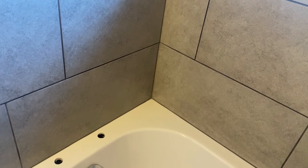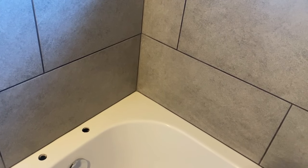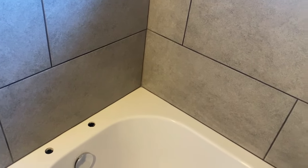Back to my channel - I've finally got the whole of the bathroom grouted, so now I'm going to mastic all the edges, up the corners and around the windows. There are two golden rules before you start: one is to make sure the tiles are clean, get all the dust off; and the second is to make sure there's no water anywhere - even if the tiles are damp, they've got to be bone dry before you attempt to mastic.